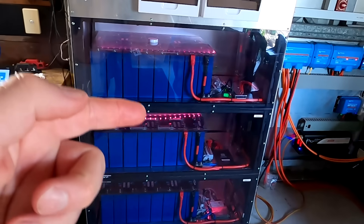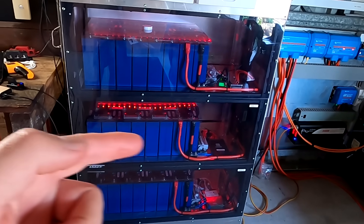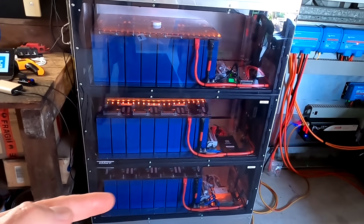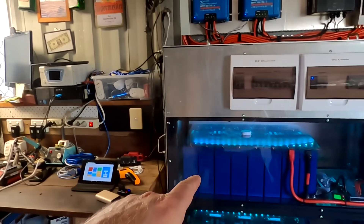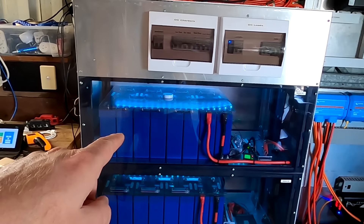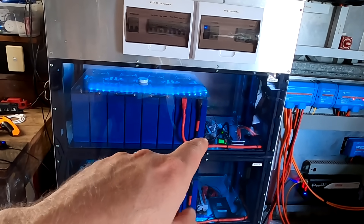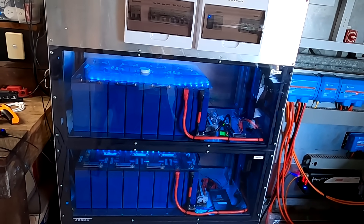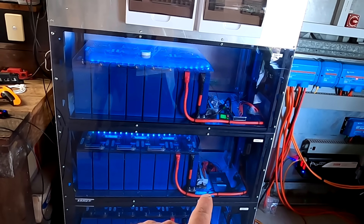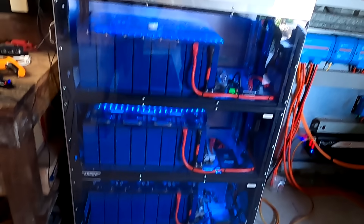After a year I realized the bottom battery was actually unbalanced when fully charged. The top battery was fine, the middle battery with the JK BMS was fine, but the bottom one had always a deviation of around 180 millivolts at 3.45 volts. The top battery is a 304 amp-hour battery with the Overkill BMS — totally fine, 18 millivolt deviation at 3.45 volts. The middle one never had an issue because the JK has an active balancer.